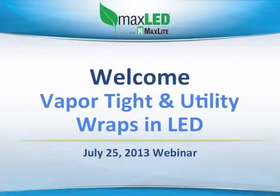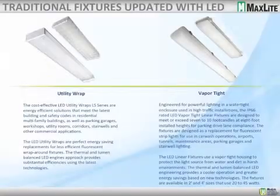Today we will review, as your invite had stated, some new products by Maxlite: vapor-tight fixtures in 24 and 48 inches, and utility wrap fixtures, also 24 and 48 inches, utilizing LED technology. Utility wraps are a cost-effective LED. These products are using the latest LEDs and do meet the latest safety codes for residential multi-family buildings as well as parking garages, workshops, and so on.